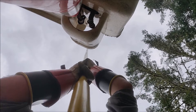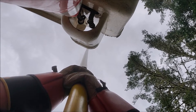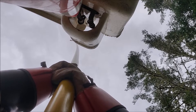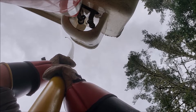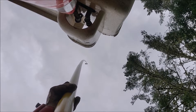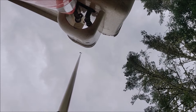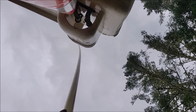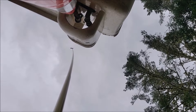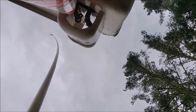With a cutout door on the stick, extend it going straight up while keeping an eye on that cutout. Once the stick is up high enough, even a slight bend makes it very difficult to extend further. Your next step is to set that door inside the cutout. With the stick straight up in the air it's pretty wobbly — there's a tiny bit of play in each section. When it comes time to drop that cutout door, lean it away from you and put a slight bend in the stick, which prevents it from wobbling back and forth.